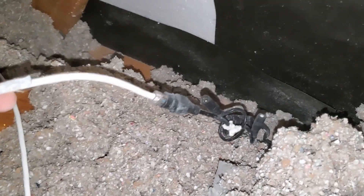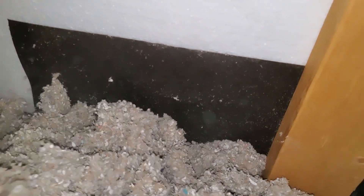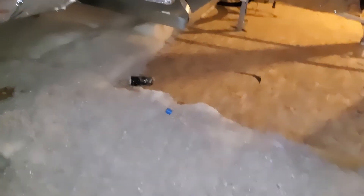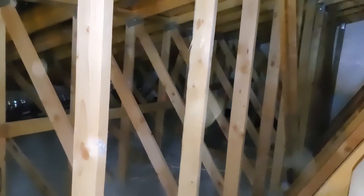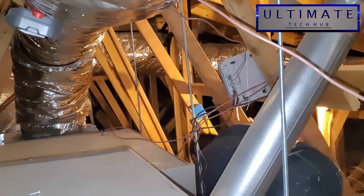That's a lot of work in here - I didn't want to film the whole thing, it was really brutal. It's about 95 degrees up here. We're good to go - it wasn't too bad but it wasn't too great. Just put the insulation back over it - I've got a long way to go. Back down from the attic. Telling you, walking those rafters is the biggest, hardest part. It seems short over there but it's really a long walk underneath those beams in this heat. Feels good to get downstairs - hallelujah!